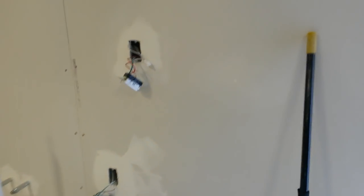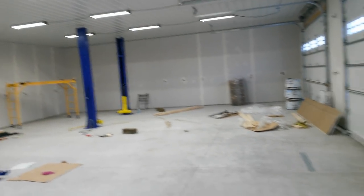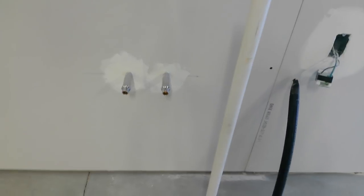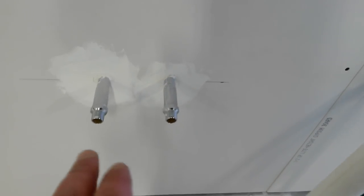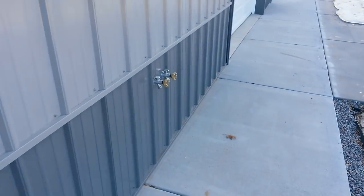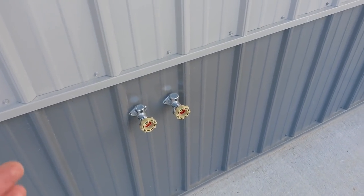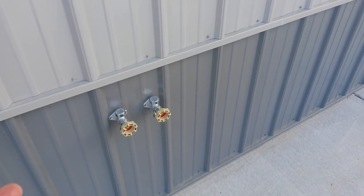Plan for your future use. Make sure to have enough electrical so you don't have to run extension cords all over the place — then you won't roll over them with floor jacks and equipment. Also think about whether you want a sink or a faucet outside; these are my frost-proof faucets going outside. Plan all of that now because it doesn't cost that much to do it during the build, and then it's already there if you ever need it in the future.